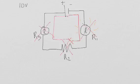Case in point, Christmas lights. If you celebrate Christmas and you've ever put those little mini lights in your tree and one of them happens to burn out, you can have an entire set that doesn't light up. So you have to go and sit there and check every single light bulb with a new light bulb to see which one it is. That is because those light bulbs are linked together in series. They're linked in one loop only.